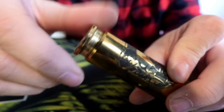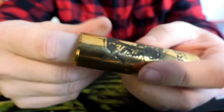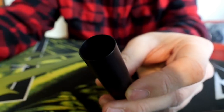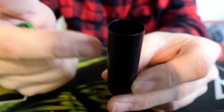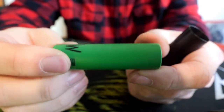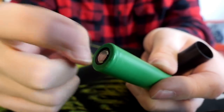The top cap is hybrid and slightly telescoping to compensate for battery rattle and to adjust for different-length 510 pins on the atomizer. Inside the top cap there's a little delrin insert — it's in there stiff. With vent holes in the switch, you can run your batteries positive side down because this delrin piece provides an extra layer of safety between your battery and the mod. Without it, I would never run a battery positive side down — any tiny imperfection in your battery wrap can lead to a hard short.